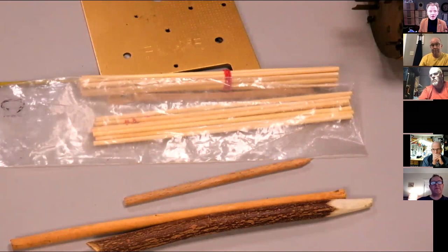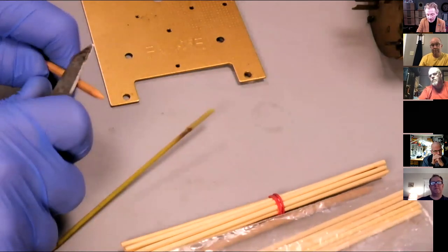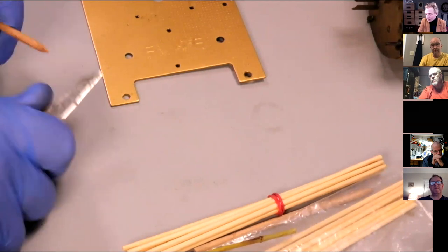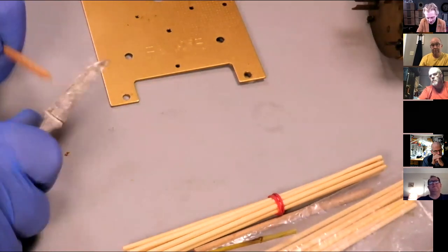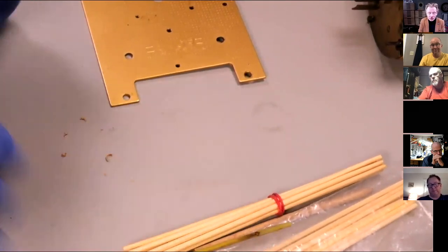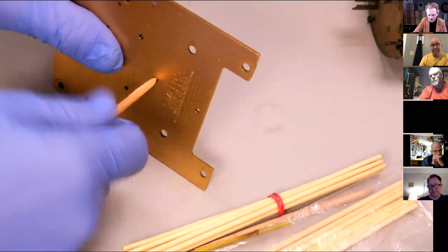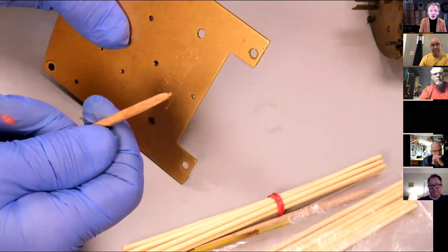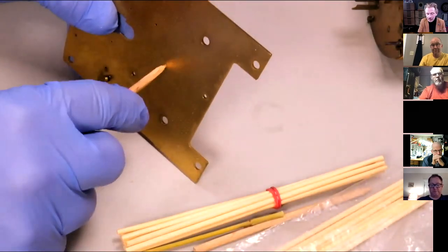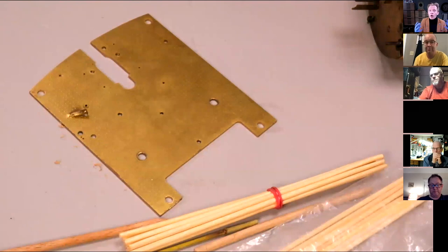So if you read any book, they say, get the wood, let's just sharpen it with a knife. Blunt knife, bad knife. Try another one, another blunt knife, or very hard wood. And then you basically shove the pegwood into the hole like this, wrong size, like this. And you do this and it comes out and it's got old oil on it. So you scrape it away again and do it again. Personally, I find this is much more effective than whatever solvent you're using, because you've got that kind of double action thing.